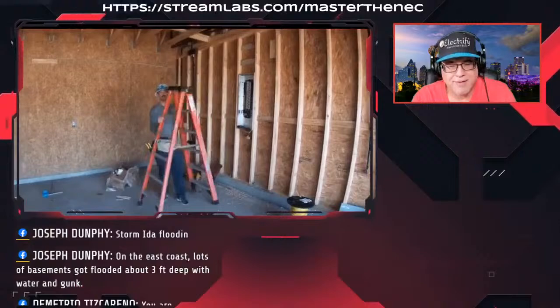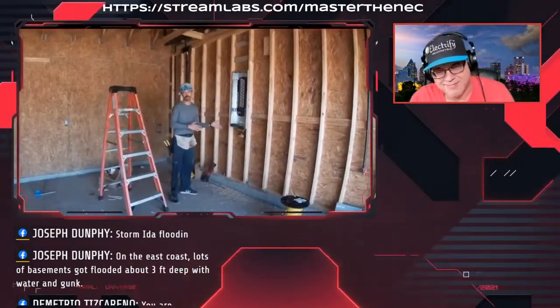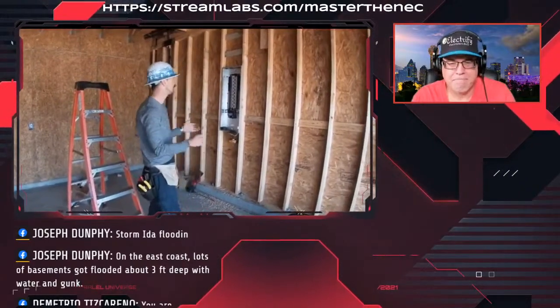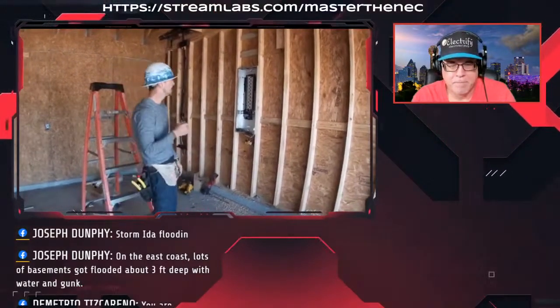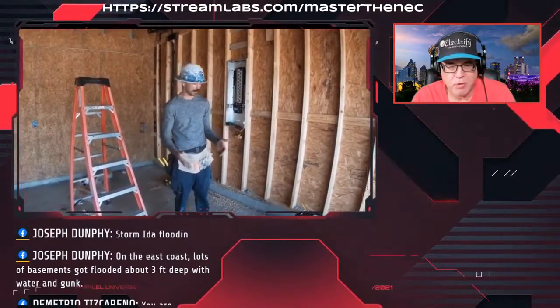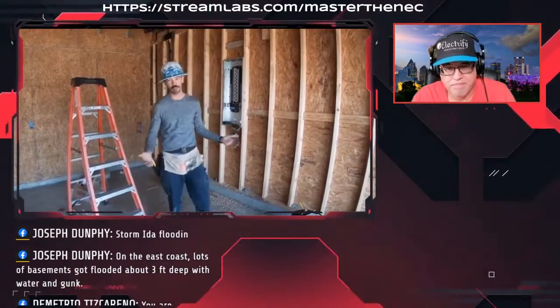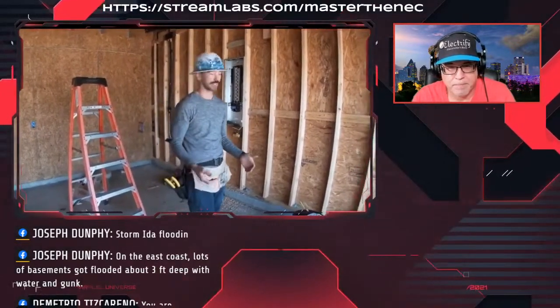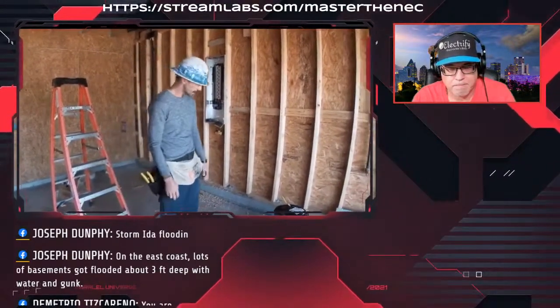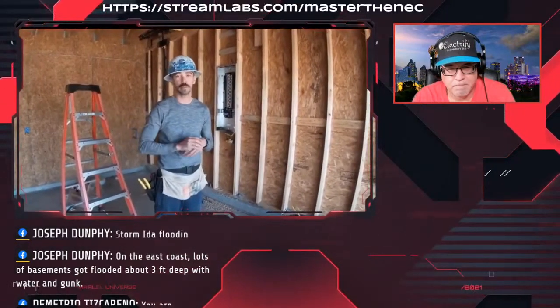Okay, in the last episode, you had to put up the panel. We've already gone through laying out the house, low boxing, hot boxing, and putting up the panel. And in this one, I want to show you the home runs. Finally, running some wire, cable. Probably 80% of our job is putting this wire where it needs to go, and it's probably the most time consuming. After I get the panel up, I like to run all the home runs. And then once I'm done with that, we can start completing circuits.